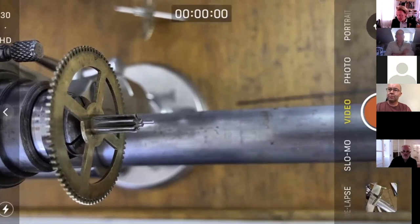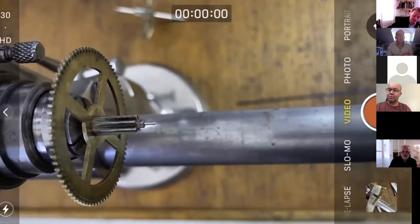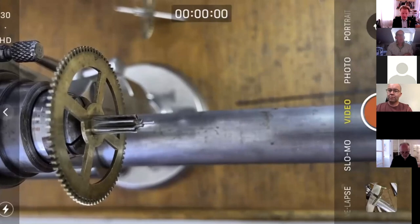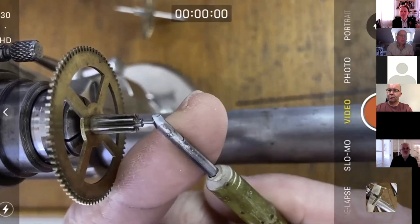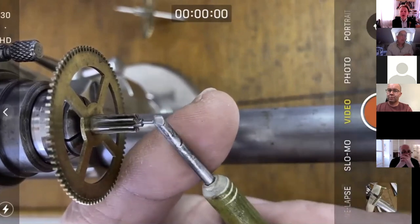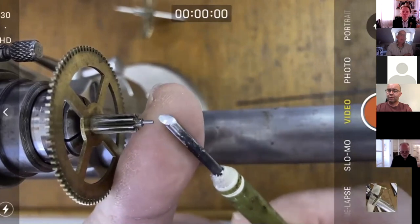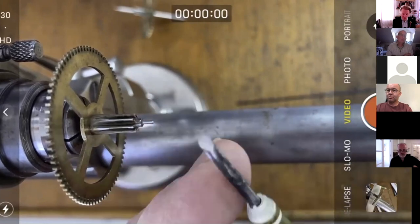Now, going over what we did last week, I've been using both carbide and blued pivot steel for turning. So again, just to catch up, we have this graver here, which I made. I can't remember whether I made that live on screen or not, but it's a bit of blue pivot steel, so it's a carbon steel. On one end, it's got a kind of three-cornered pyramid-shaped graver, which is really useful. And on the other end, it's got a sort of elliptical one. I'm trying to remember my conic sections there. Ellipse, isn't it, I think? Yes, it is. Really useful thing.